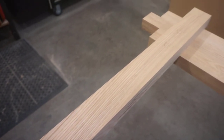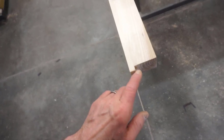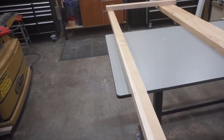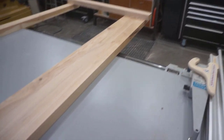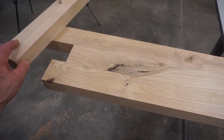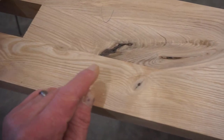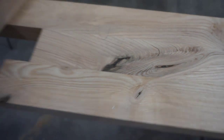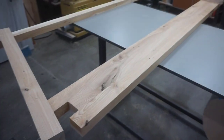The rails for the top and bottom of the door are just pieces milled out of those runners, where the stiles had to be glued up. The hinge stile is made up of two pieces — a thin one and a thick one — to get the two and a half inch width. The latch stile is made up of three pieces; it's noticeably wider because of the proportions I wanted. And if you look close, you can see that piece of copper wire that ended up in the pallet wood.